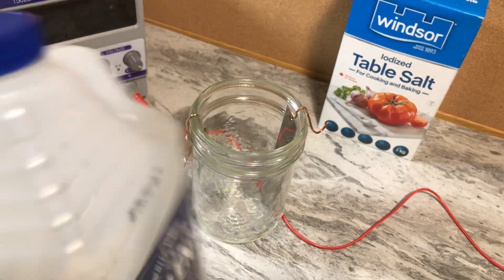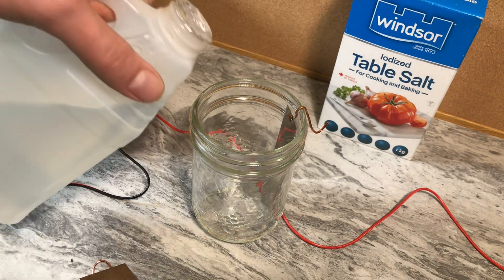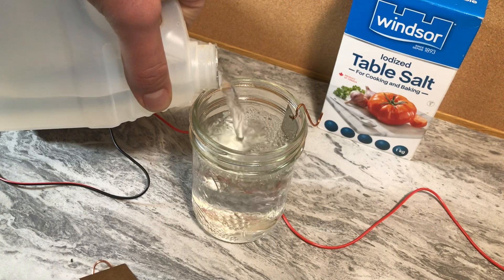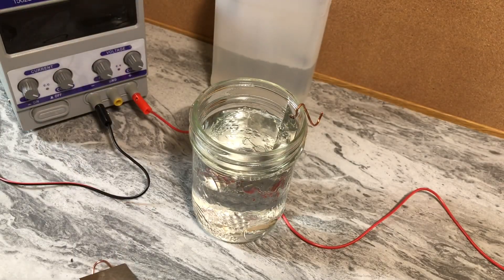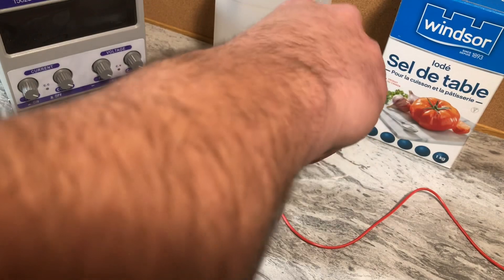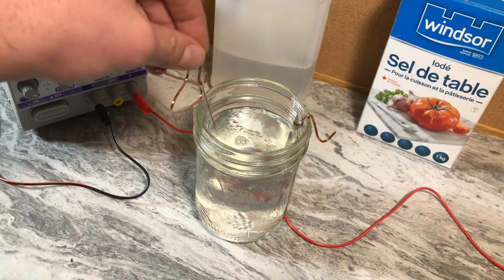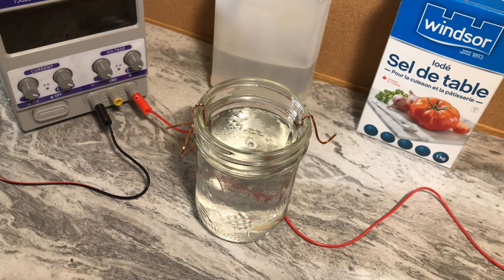You're also going to need your vinegar — just plain white vinegar. I'm going to take the cathode out for a second; it doesn't matter if the anode stays in. I fill it to the line on the jar, then add just regular table salt — only about a bit of a spoon is enough. Give it a stir. You want to have a solution before you start plating because it's going to go much faster for you.